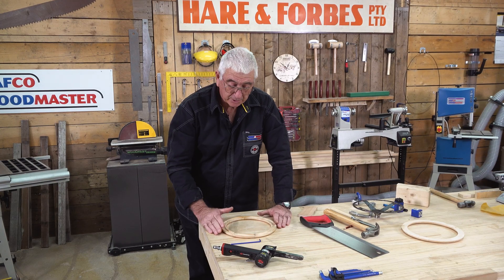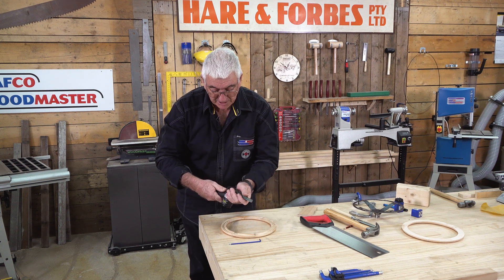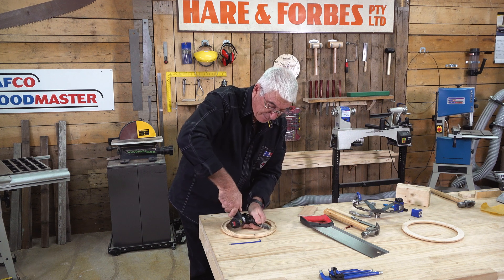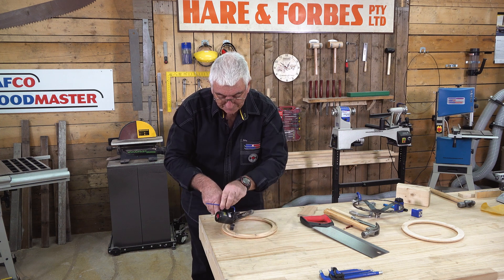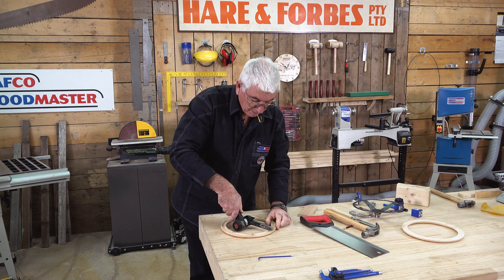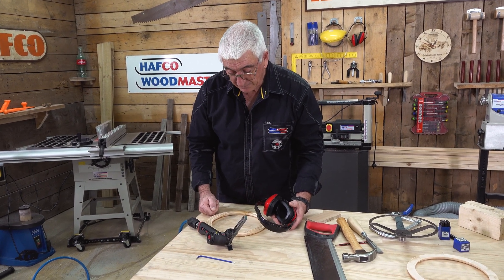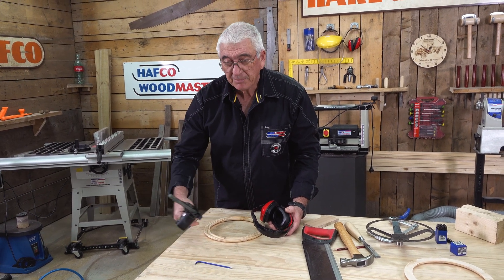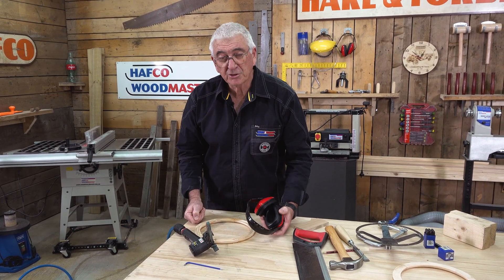The second method is using a small belt sander — this one is an air powered tool with an adjustable head, which is very handy as I can manipulate the angle to get the job spot on. I can tighten it once I've got the angle I require. Using an air powered tool, I'll need my PPE — hearing protection obviously — and you need to be very careful. Control the trigger very gently because it's a fast tool that will remove a lot of material very quickly. A lot of control is required.